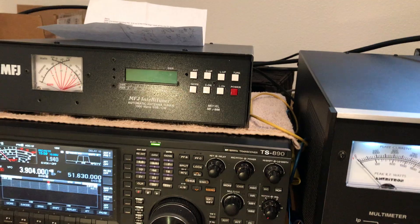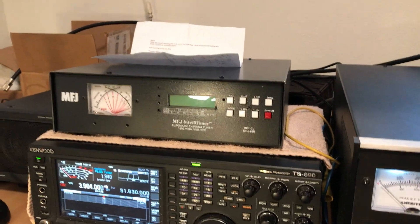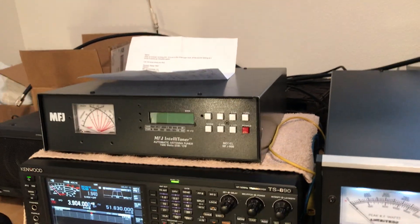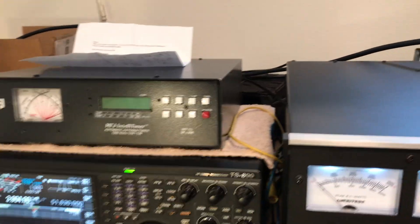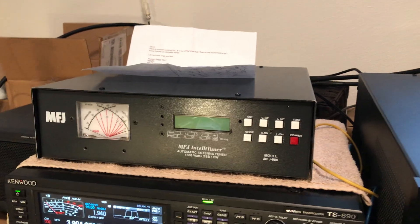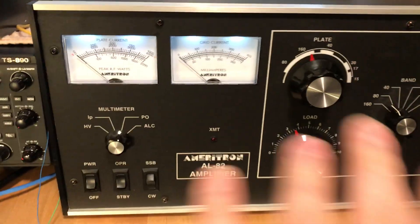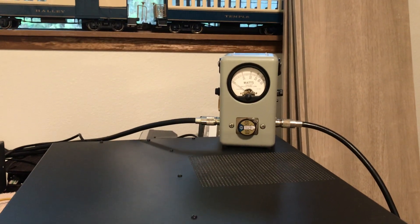The book says that if you try to exceed 1500 watts into the MFJ998, it's supposed to go to bypass mode. It's not supposed to do that anyhow, because bypass mode means open the relays and take the relays out of the circuit — you don't want to do that at 1500 watts. Be that as it may, that function doesn't even work. When you exceed 1500 watts, it says overload and starts squawking CW QRT, but it does not disable the amp, does not drop the amp enable — commonly called the push-to-talk line. It'll let the amplifier sit there and pump out 1500 watts, which could damage the tuner. That's why the feature is there, and it's going to let you operate illegally. You don't want to do that.